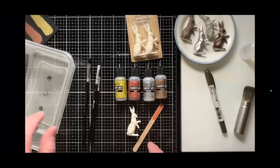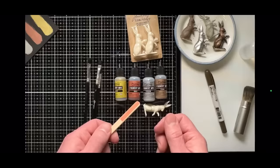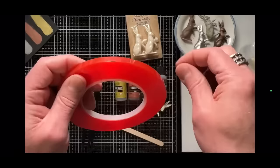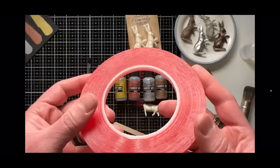One thing that changed in this demo: in the past I talked about using hot glue to attach something to the stick, but I found that red line tape is more heat stable than hot glue. When you try to emboss or heat the foundry wax, it remelts the hot glue and the piece falls off. This is called red line tape — I call it baloney tape — and it's a heat-stable tape available in all different widths.